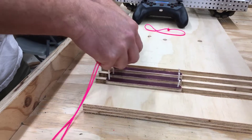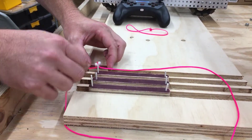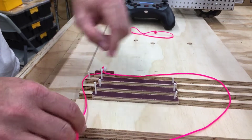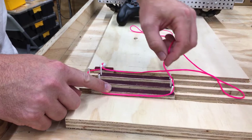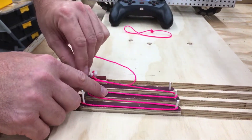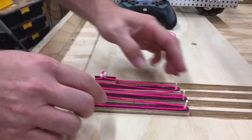Just like in the robot shown earlier, we're going to come off of stage four, hit that fixed peg — that fixed pulley on the chassis of the bot — come up under one, over the top of one, bottom of two, top of two, bottom of three, top of three, and back down to four.